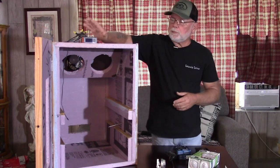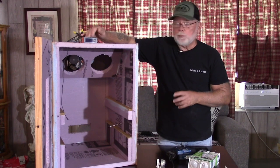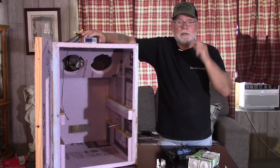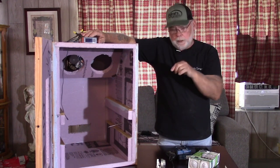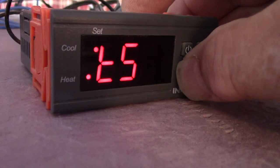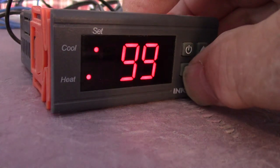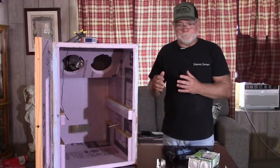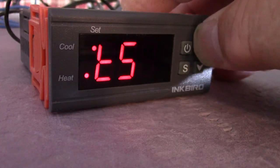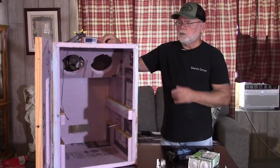As far as the Inkbird, I have never had to replace one of these — I've never had one fail on me. This one here is better than three years old and it's still going strong. We did do a video on the settings you want to use for the Inkbird — I'll go ahead and link that in the description down below. Make sure that you change all three settings, because if you don't, you will run into issues with temperature variations. It might not turn on when you expect it to, or the temperature drops down a little too low before it turns back on. There are three settings you want to make sure you change on the Inkbird to make your incubator function properly.